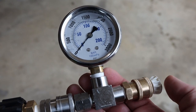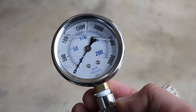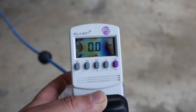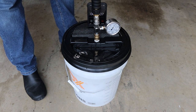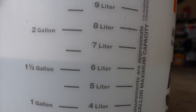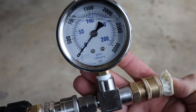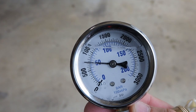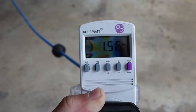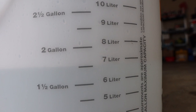Okay so we went up one nozzle size. This is my favorite — this is my 3.0. I'd say about 925 PSI, it was creeping up towards the 9.5 mark at the end, continuing to build pressure. Much safer at 12.8 amps. The 3.0 did between 1.5 and 1.75 gallons per minute — I'm thinking 1.6 gallons per minute. I have a 3.5 here on the end; I'm thinking that's about the lowest we can go. If we went to a 4.0, I think the PSI would be just way too low.